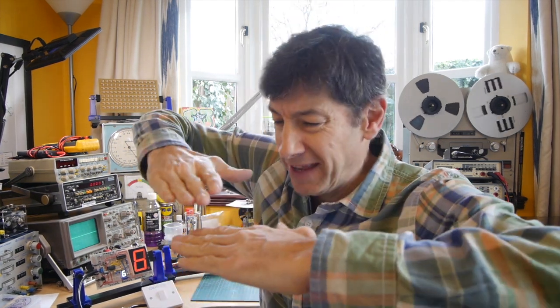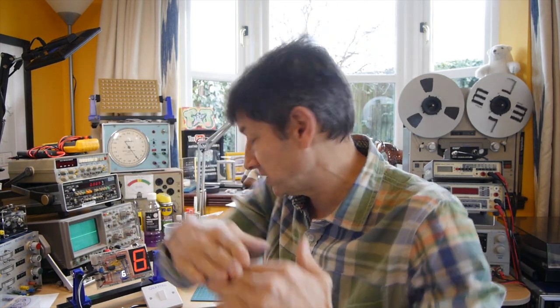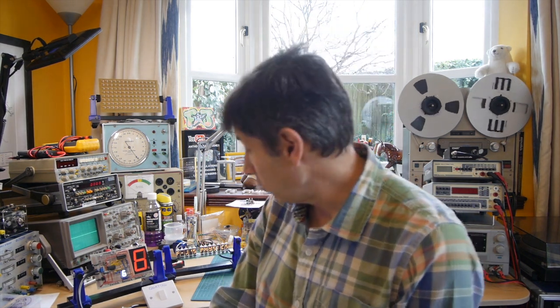Also, the surfaces might not be completely flat — they clearly aren't on a simple mains switch. So it sort of contacts, then disconnects, then contacts and finds a nice place to contact finally after six attempts when the spring is pressing hard. Why does it matter? Why have I gone to all this trouble? Well, in high voltage, high current circuits there are some serious issues with switch bounce, and in low voltage digital on/off circuits there are also lots of reasons you don't want the switch to bounce.